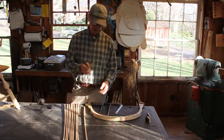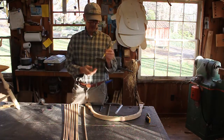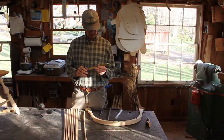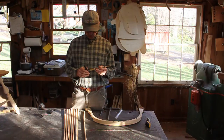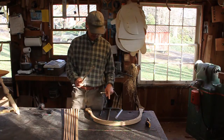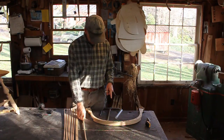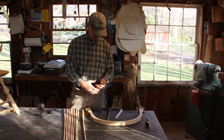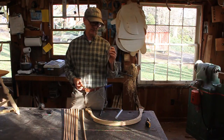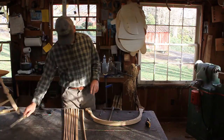The reamer is really fast — just pop it in the hole, couple of turns, try the spindle to it, and move right on. This is the same reamer I used to taper the arm support holes. But I've matched the holes to what the rat tail file does, and I'm going to show you how to do it with the rat tail file, because it's not an expensive tool and you can find it at your hardware store or order it online.